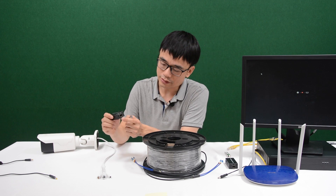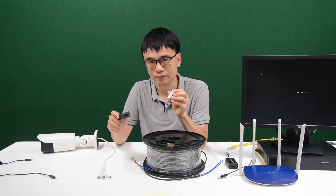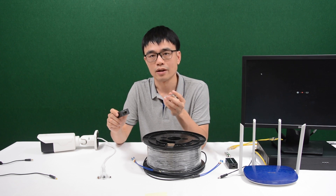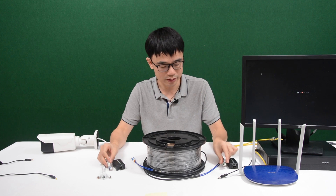You can see this is the SFP slot — it's empty. The reason is because we still need to have this SFP transceiver. The SFP transceiver will determine what kind of cable and connector we can use. So we also need two SFP transceivers, each for one side.